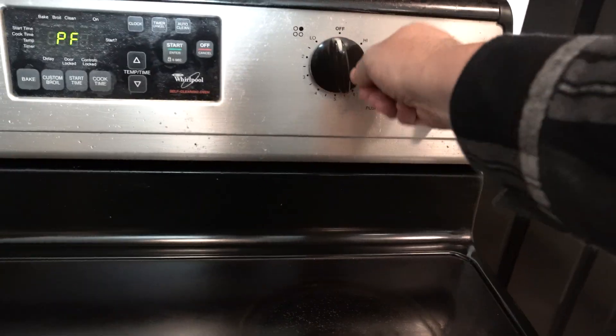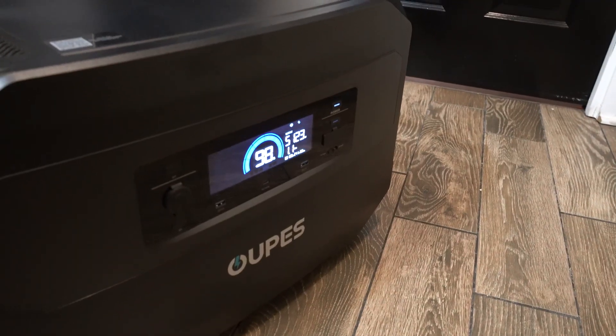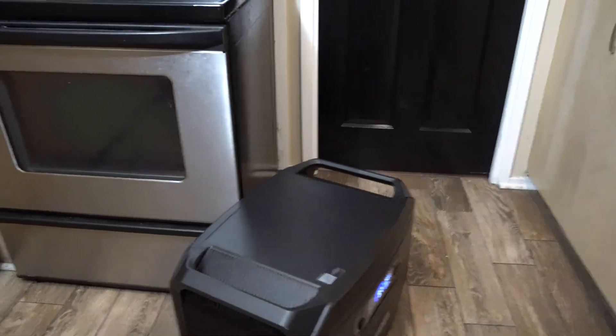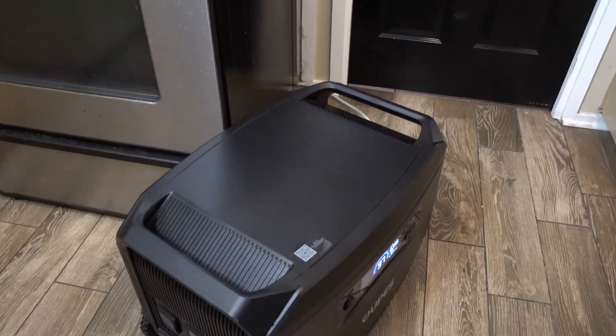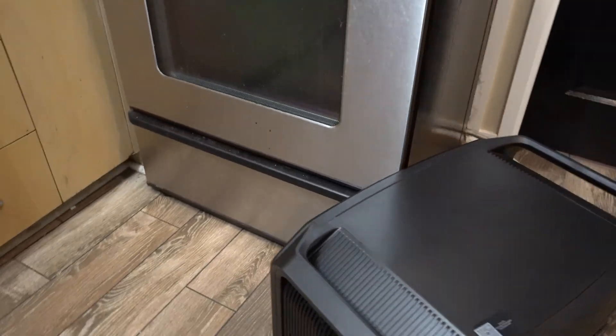Turning off the small burner and adding one of the large burners — with the refrigerator and burners on, I'm at 60 decibels with the fan. Let's turn off the small one and run two large burners. That jumped up to 5,000 watts and now the fans are really going — 67 decibels. Whenever they're both heating, we're looking at about 5,000 watts. So I can run at least the two big burners at the same time. Adding a small burner makes three burners at 3,700 watts, surging to 6,300 watts. We're up into boost mode already.